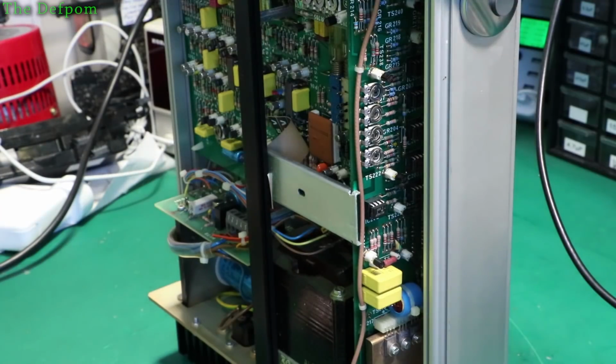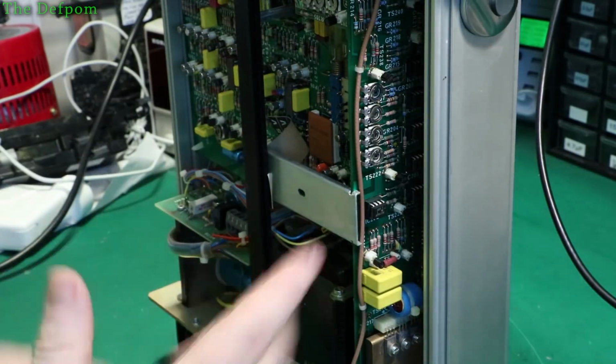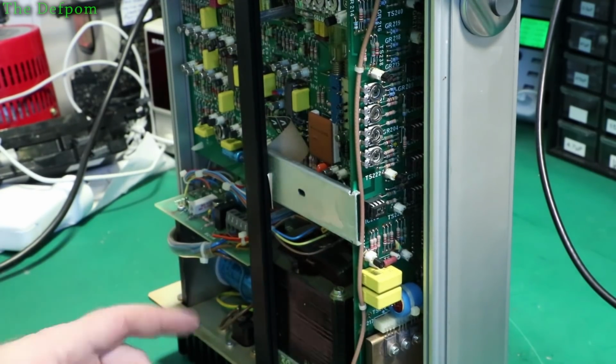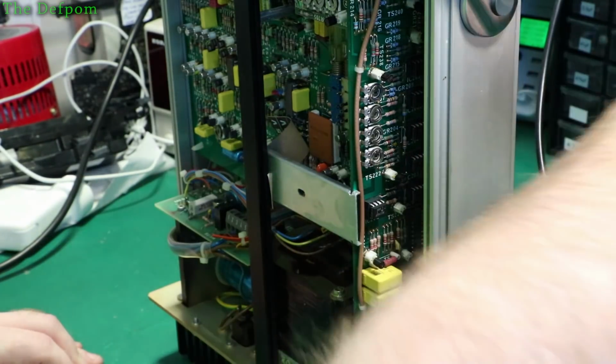So I'm just going to use one of them. I'm just going to pop one out, swap it out, see if anything changes. And let's do that for each one until either it fixes itself or nothing changes. If nothing changes, I know it's none of those, and I have to look a bit deeper. But my experience has been op amps are one of the first things I look at. If there's op amps in there and something's not working, I'm always suspicious about op amps. That's where I always think the problem is.